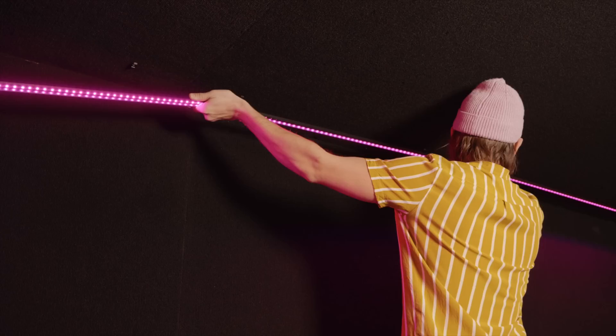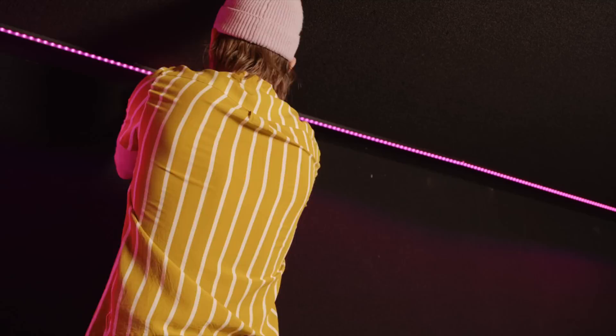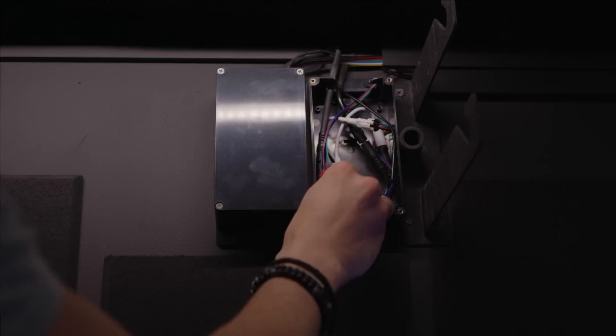I also realized I had about 10 feet of cabling coming from the controller to the first LED strip running right alongside the cables for a 24-volt LED strip on my ceiling. That interference was causing additional issues. Once I separated them into different wire channels, some of the flickering went away. Make sure there is no interference next to your cable running from the controller to the LED strip.